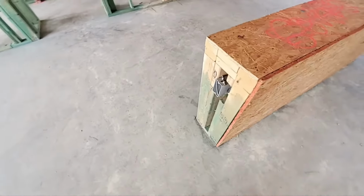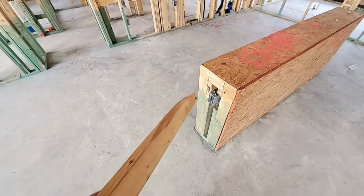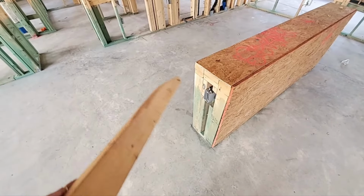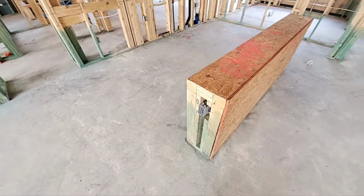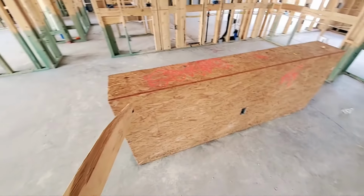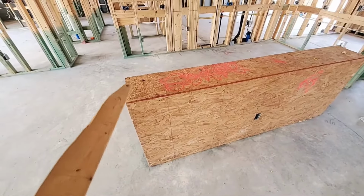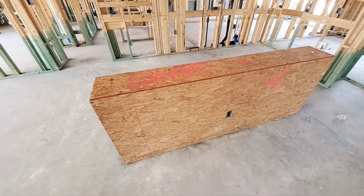The reasoning behind that is that you got a crock pot or something here with a cord hanging down and plugged in. It could be pulled, tripped over. Certainly don't want a crock pot full of hot food spilling on somebody. So, what's the answer? Well, they're saying now that you need those ones that lift up, or countertop outlets.